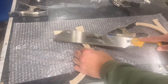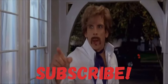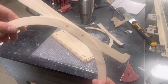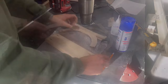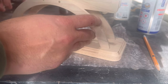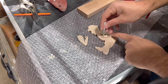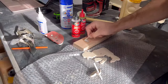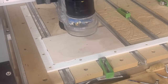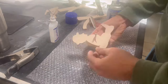One quick note: don't saw in the direction of your hand, because things like this will happen. Luckily I survived and cleaned everything up with sandpaper — in the end, no one will ever know the difference. With the rails and supports complete, we can now insert them into the base. After lining them up correctly, I secured them using CA glue, though you could use wood glue if you prefer. Our next step is to assemble the acrobat by securing his arms in place using that metal rod we cut down earlier. I initially tried epoxy weld, but that was a mistake — it got all over the wood and was impossible to sand. I went back to the CNC, carved new components, and assembled them using CA glue, which worked out much better.